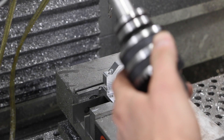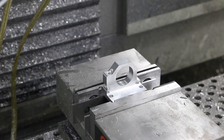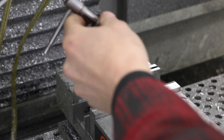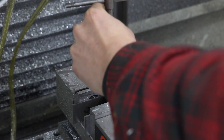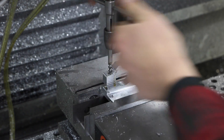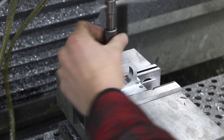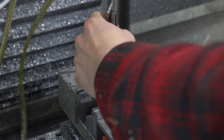Let's tap this hole in the machine. I looked at the Sprutcam model and saw the coordinates are G01 X0.375 Y-0.25 F20 — that puts us right above the hole. I've got a spring plunger guide. I'll drop a little coolant down there. Using a spiral-fluted tap so we pull the chip out — notice it fits through the clearance hole perfectly. Pre-tension, then boom. Once you've got it started you can frankly do the rest offline. You can see the chips coming out, which is perfect.